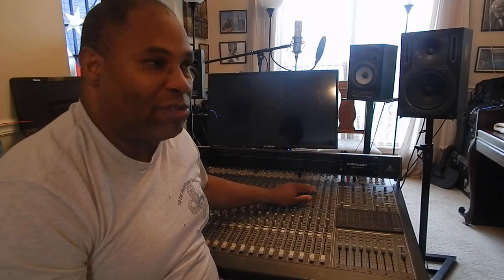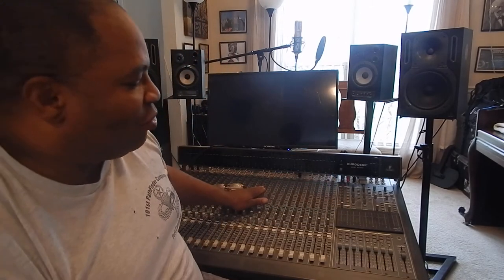Because I do a combination of virtual instruments, synthesizers, as well as real instruments like my trumpet, sax. I still use bass guitar. I still use acoustic guitar. And I'm definitely going to do vocals. Recording vocals does not require a console. It basically only requires a really good preamp. Most of the time, the preamps in your audio interfaces are okay. But using an external preamp, especially a really good one that maybe has tubes and transformers, or at least transformers and discrete op amps, those types of circuits are going to benefit recording vocals the best. You don't have to use the console for that.